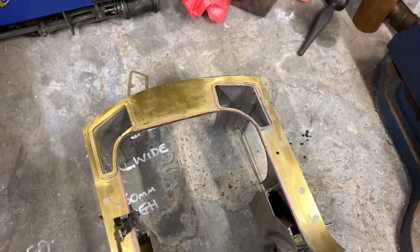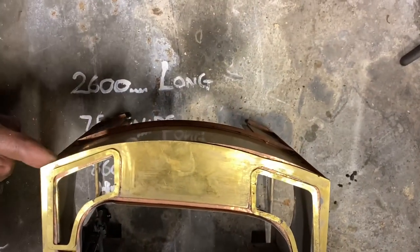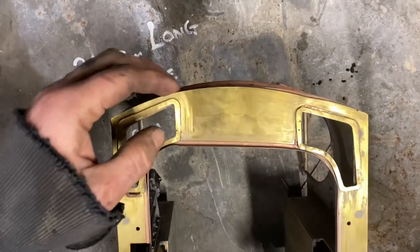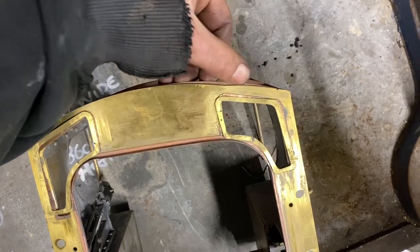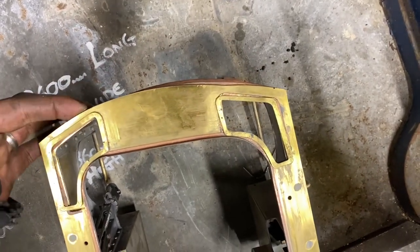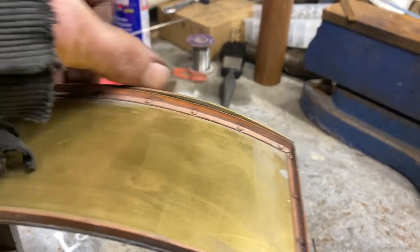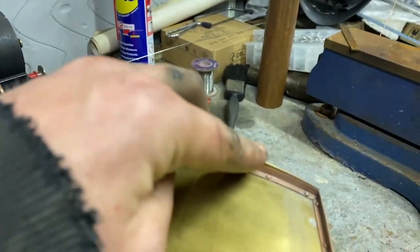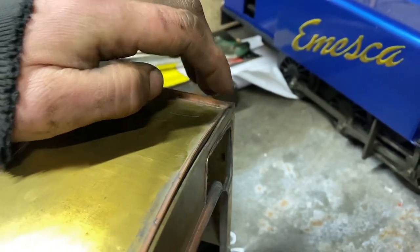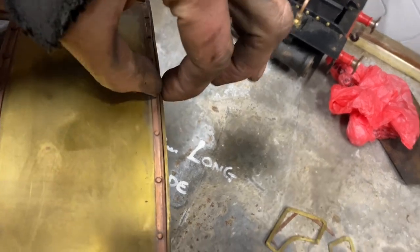Once I've painted it, I can scrape the paint off to leave them as brass frames, or I can leave them painted — we'll see what Rory wants. Also, the line of the rain strip is different to the line of the cab. I intend to place a piece in there to tidy that up, solder it in, clean it up and file it back. When you look at it from the other side, it sits proud of the rain strip, so I'm going to file that back and find a piece of something to solder in so there isn't a gap. I'll clamp that and solder it.